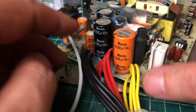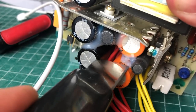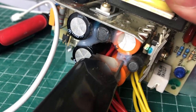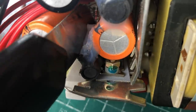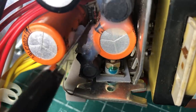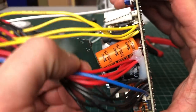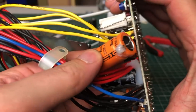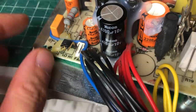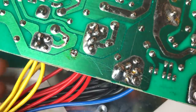On the output there's an electrolytic capacitor on the 12V rail which looks pretty good, but I decided to remove it to check out of circuit. All of this stuff is glued together, which is really annoying — even after desoldering you still need to cut away that adhesive residue to get the component out of the PCB. With the capacitor removed from the 12V rail, I checked if the short was still there.